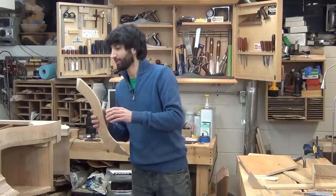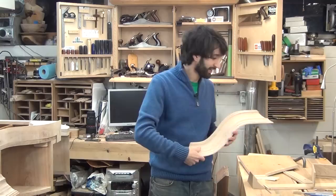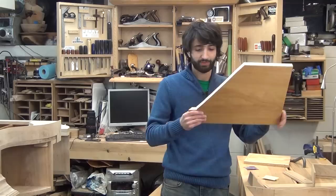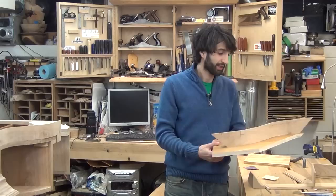The most interesting thing about these moldings is cutting the miters. That might look tricky because this is all curvy and there's no good reference spots. If you're good with a hand saw you can just draw a line and cut to it, but I'm not sure I am, and I don't have a nice crosscut saw for that, so I use my miter saw. That was really easy to do using just this little — I don't know if you'd call it a jig — it's just a piece of plywood that I cut here to relieve some material for the saw head to come in. Over here I have my saw angled at 45 degrees and I made a cut on the edge of the jig, and that allows me to see exactly where the saw blade is going to cut.